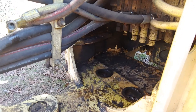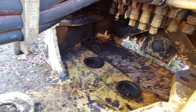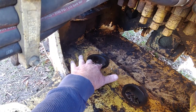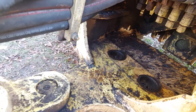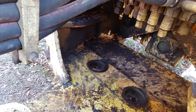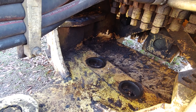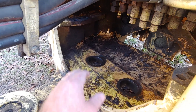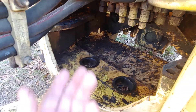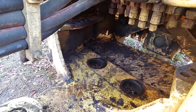We've had to replace some hydraulic lines on the swing cylinders on the 555A Ford backhoe. These spots here where the bushings are is where the trunnions fit — that the cylinders react in order to manipulate the boom from left to right. We had a busted line on one cylinder, and regretfully, to get to the busted line the whole cylinders had to come out. So instead of repairing one line, since you've got to go through taking your top plate out and removing both cylinders, it was just prudent to go ahead and remove both cylinders, repair both lines, and make a thorough inspection of the two swing cylinders.